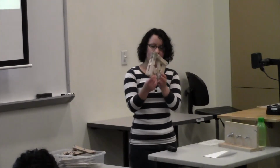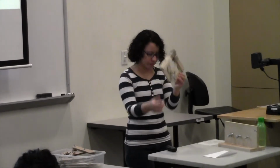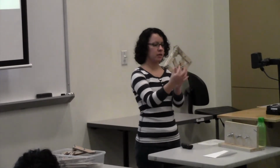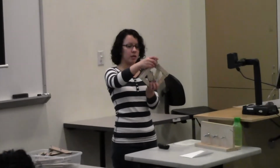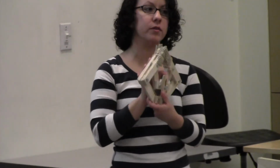And on this one, I just cut it out as one piece, so then I didn't have to worry about reinforcing it and not having it move. And then this right here can only move in one direction. So for this one, we made a track. It can only move in one direction, because if you allow this to move, it won't work symmetrically. So in this piece, you want to build a track or use gears, which I'll talk about a little bit later.